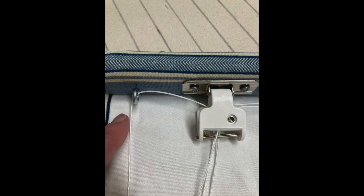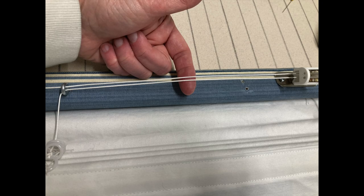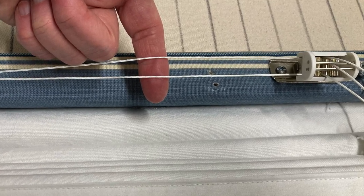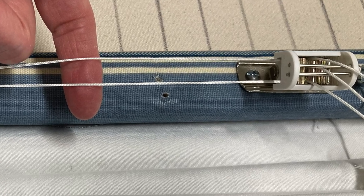A couple more tips to mention. Some people ask if you can use the cord lock itself as a screw eye — I recommend that you do not. I always make sure there's room for a screw eye before the thread actually goes through the lock. I think it just works better when the cord comes through horizontally instead of from underneath. Also make sure your strings are not twisted together or tangled as they're fed into the lock. As they come out of the lock, you want them to be nice and even and separated to ensure a good smooth operation.